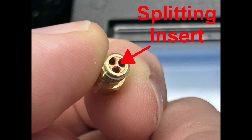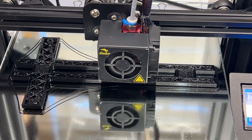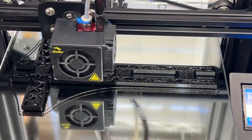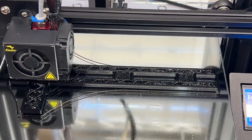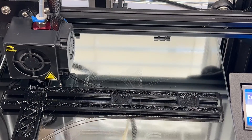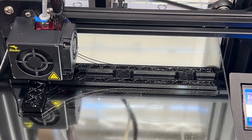The differences are so subtle they are hard to see on camera but I noticed them in person. I run my print speed at 50 millimeters per second, which is fairly fast for PETG being pushed through a 0.8 millimeter nozzle and laying down 0.4 millimeter layers. These nozzles have had no problem keeping up with that pace.